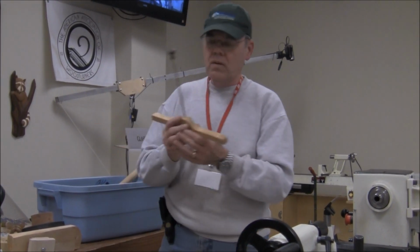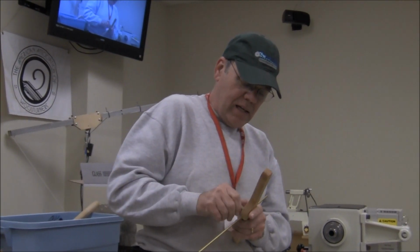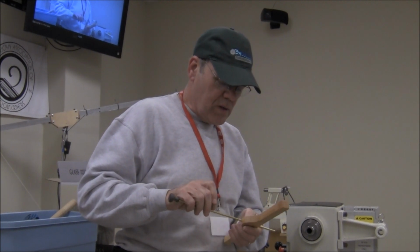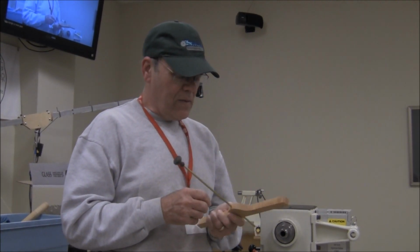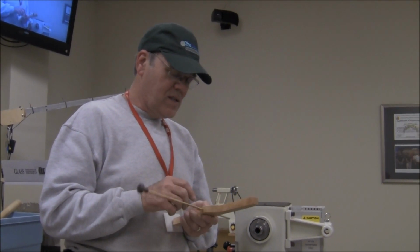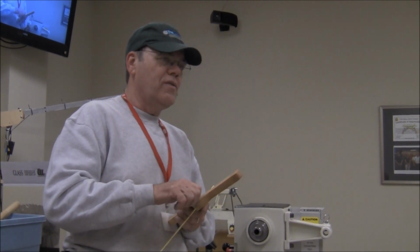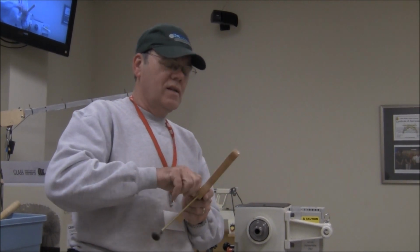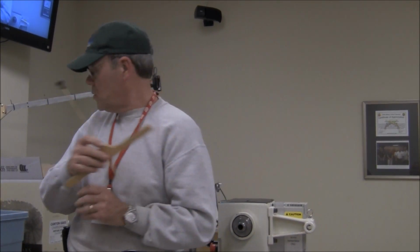I've got a bowl depth gauge doohickey too. Frank Penna had this design in one of his handouts, but it was real slick the way the thing tensions up on it. I can't even remember. You've got this piece with a hole drilled through it, and this pulls on it, and it frictions against this rod to keep it stiff, so you can measure your bowls with it.